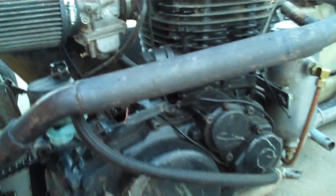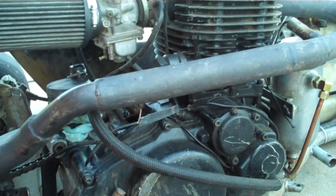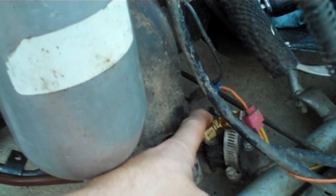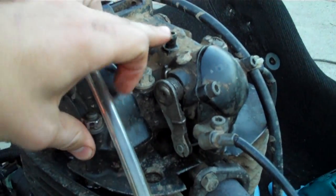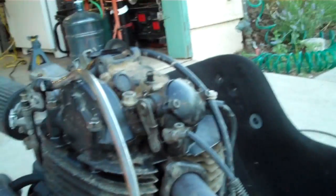In the normal bike configuration, this output line goes into the top tube of the chassis, which is then gravity-fed as it drops down the front tube into the fitting I have here, back into the motor. That tank is also ventilated to the top vent port of the cylinder head.